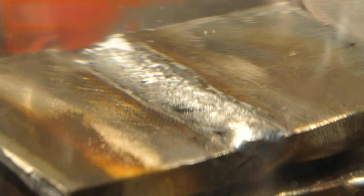Hydrogen embrittlement is not going to cause visible pores like this - it could be that the escaping gas played a role, since the rod was smoking because of how much moisture was boiling off. All of that likely played a role in this porosity, and ultimately the rod was simply too contaminated to make a decent weld. This second one passed - it could be that enough moisture baked off to where it was easier to run a decent pass.